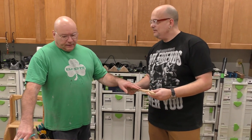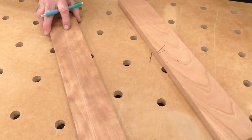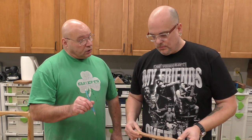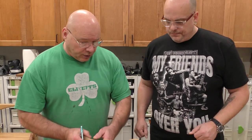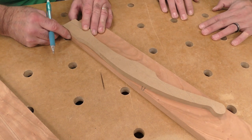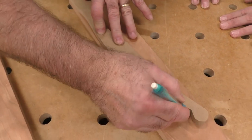So the process is we have our template and we're going to lay it out on these two pieces of cherry. This is going to be our saw frame. What we're going to do is trace it out, cut close to the line, and then take this template with double-sided stick tape and duplicate it on these two pieces. I'm going to show you a little trick — I know this is flat and flat, so we'll never have to touch that. I'll show you how that comes right in here.